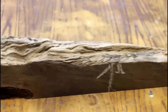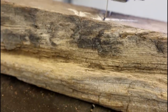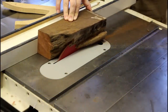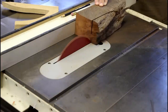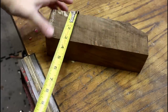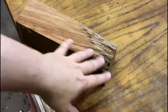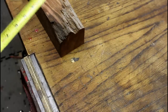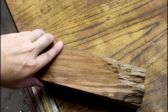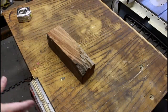What I've got here is a piece of redwood burl I picked up at a salvage yard a couple of years ago, and I think it's going to be perfect for this project because what I want to do is marry some wood and resin together. We've got a piece of wood that is now 3 inches square and 10 inches long that sort of crackles off into the distance. We're going to make this 13 inches long and fill this section up with resin. It was supposed to be redwood burl but that's pretty straight grain — it's still really pretty though. So now we've got to build a form for the resin.